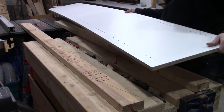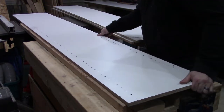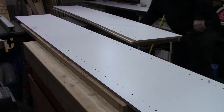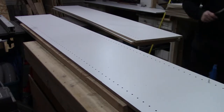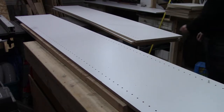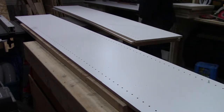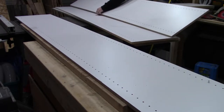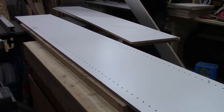With the shelving all cut to length, I moved onto the sides of the cabinet. We decided to go with these pre-drilled melamine sheets for the sides of the cabinets, much for the same reason as the MDF shelves. Going this route probably shaved 4 days or so off the total length of the project, since I really didn't have to paint anything other than the wall. And since the panels were pre-drilled, it meant I didn't need to spend an hour or two drilling the 568 holes I would have needed otherwise.